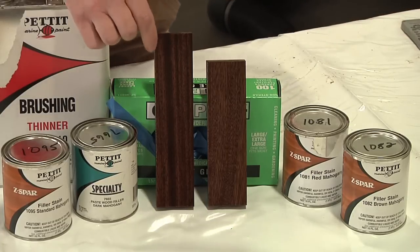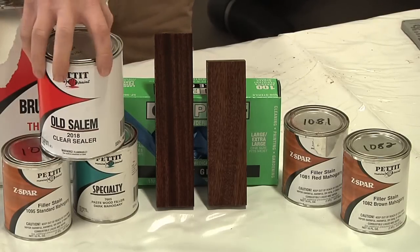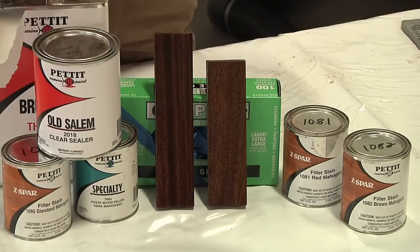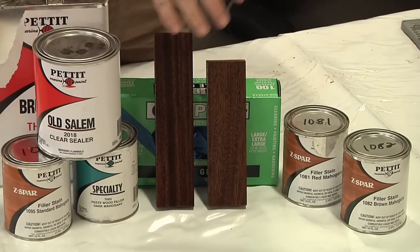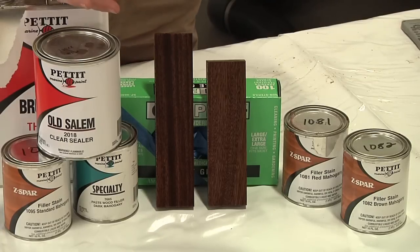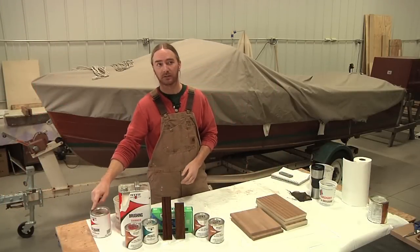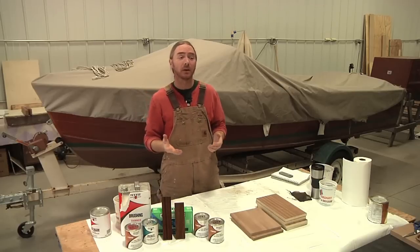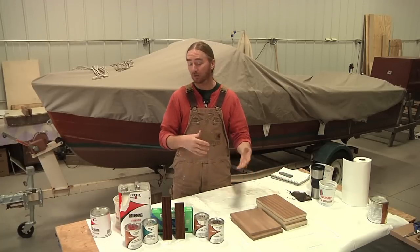One of the ways to manage unevenness in the staining is to use a clear sealer. You apply it over the bare wood before you even put the stain on — it seals the surface so the stain covers uniformly. On some parts you may need it, others you may not. For my samples I'm not going to use the seal coat, because I want to see what the variations are going to be between the different types of grain cuts.